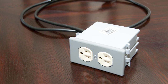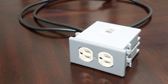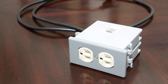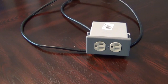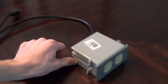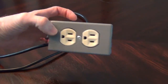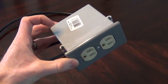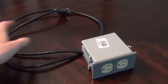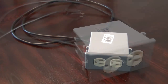So once you've got it connected into a home automation controller, there are many other possibilities, especially when using the program logic event generator, or PLEG, plugin with the Vera. I made this module for around $8 because I was able to reuse some parts that I had laying around the house, like my outlet and the gang box. But I'm guessing it would cost about $10 if all new parts were used. I know it's not the most attractive case, this gray plastic here, but it's going to be kept hidden behind my couch, so looks don't really matter to me.